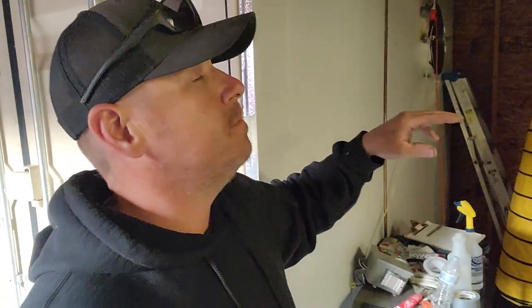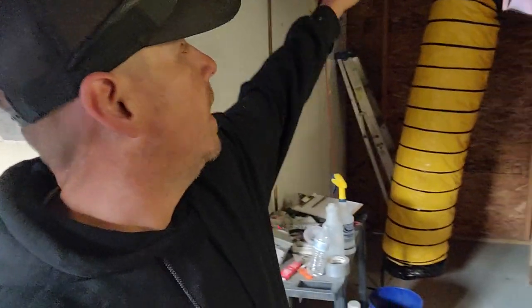I'm using my 25 horsepower boiler. I can't even open the steam all the way on that two-inch pipe or it'll pressurize the container. The first time I tried to get it up to temp fast and opened that valve up, I literally saw the container walls expand — at that point I knew it was too much. So I barely have that valve cracked open and it maintains temperature in there.